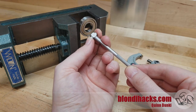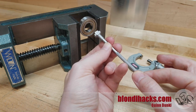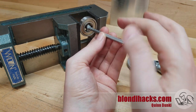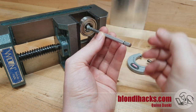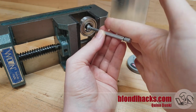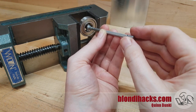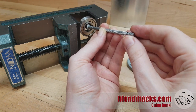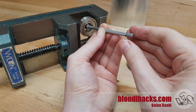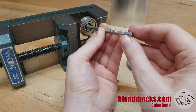What I'm going to do is collapse the anvils and tighten the thumb screw so the anvils stay collapsed. Then I'm going to insert this into the bore, get myself visually aligned on the vertical centerline of the bore, and tilt the handle above horizontal. I'll try to hold the center roughly in the middle of the bore, then loosen the thumb screw — and that's the snap — that's why we call them snap gauges — and then snug up the thumb screw again.